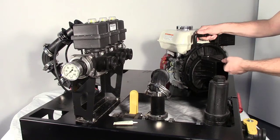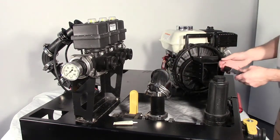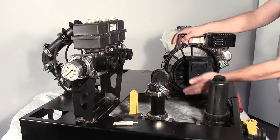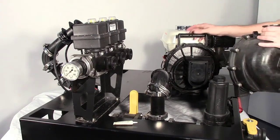Reinstall the volute onto the rear bracket using the 3 volute screws. Reinstall the check valve onto the snout of the volute. The drive unit should be turned over a few times to check for clearance between the impeller and volute. A small amount of drag between the impeller and volute will cause no problem. However, if the drive unit will not turn over because of the lack of clearance, a shim may have to be used.